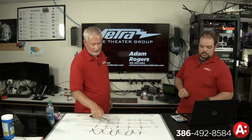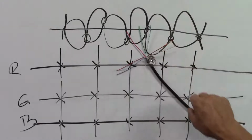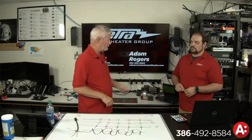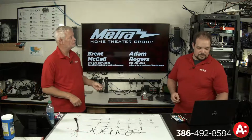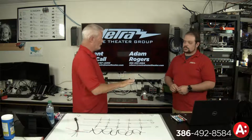And by the way, that is the 4th channel of the TMDS feeds: a clock. And the clock's only job is to keep time, to tell everything where to be and when to be there. That's it. And when those things are out of sync, you miss the bus. And the more it's out of sync, the greater the chances of failure.